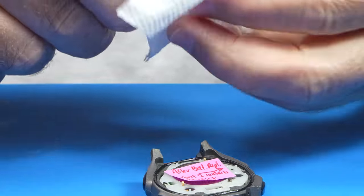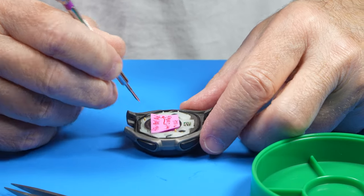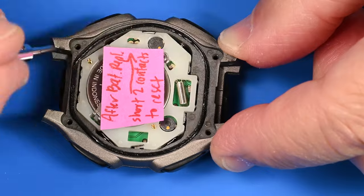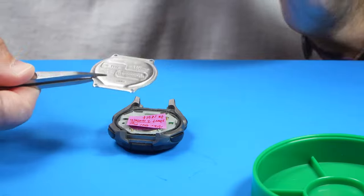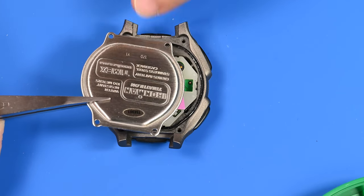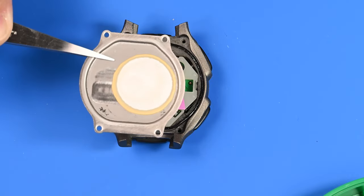Clean those tools as you go, because you don't want to accidentally get silicone on something that shouldn't have it. And now we can seat the gasket. Don't want to press too hard, though, because we don't want to damage the gasket. Okay, that's looking pretty lined up. So this looks like a pretty symmetrical back. Actually, the ledge on the bottom end is a little bit deeper than the ledge right there. Either way, we want to make sure we put it on correctly because there's that insulator on the back.